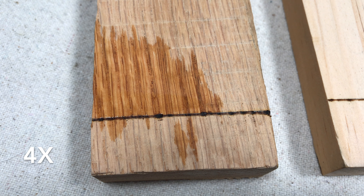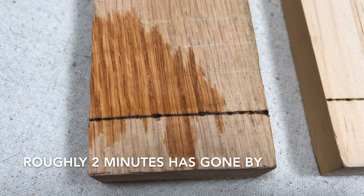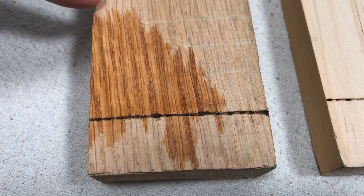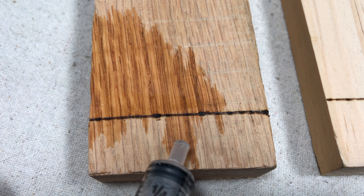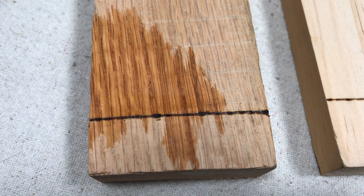You can see that this oak is really absorbing the water. The burn line that I put in there did stop some of it, but obviously it is not going to be sufficient. So if you want to paint oak, you most likely don't want to use acrylic paints — certainly don't want to get it wet — it is going to run with whatever paint you have in there and it could mess up a pretty important project, especially after you have spent so much time working on it. So keep that in mind.